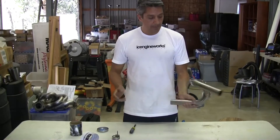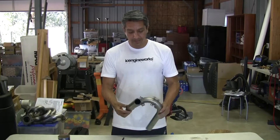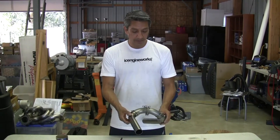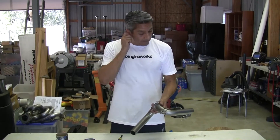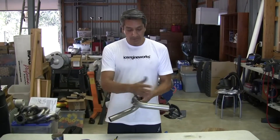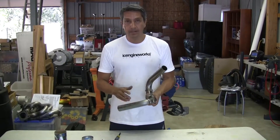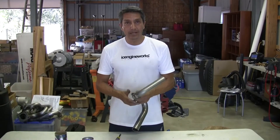On a single pass, we are ready to go. We don't have to be guessing anymore. It's all a single piece that we know works and should stay like that after it's tack welded. After that, it's a matter of completing your welds and installing your collector, and essentially the hardest part of developing a header is completely knocked out — eliminated and now simplified.